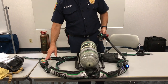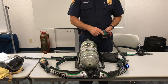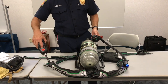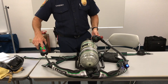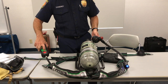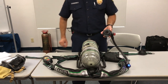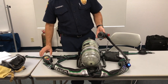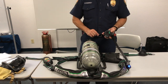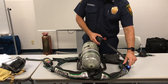With a full cylinder at 4,000 PSI, you should have four green HUD lights and green flashing buddy lights, as well as the area around the red manual PASS alarm flashing green periodically. The HUD lights will go out; to re-light them, a single press of a green button on either side of your control module will light up your HUD lights again. Your speaker module should have come on as well.